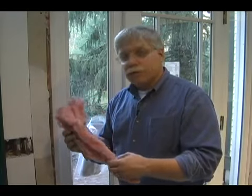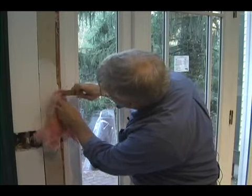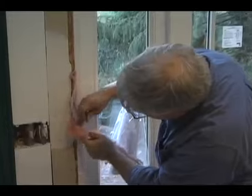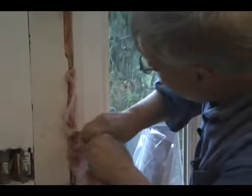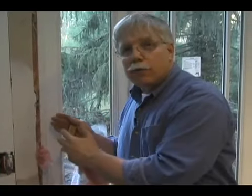I have to tell the truth — we finished putting the door in yesterday and it got a little late to finish the job. I went ahead and already insulated with pink fiberglass so that cold air wouldn't pour in through the night, but I want to show you how I did it, so I removed some right here. You take fiberglass insulation in narrow strips, and you rip off a piece that's a little bit longer than the gap that has to be filled. You want it to be kind of loose — you don't want to pack it in too tightly. I like to just use a wood shim or some small stick and start to stuff it in very easily. The key is not to push it in too tightly — you don't want to pack it in. Depending on how deep the door jamb is, you might have to put in two or three inches. I put about three inches of foam outside and we're going to have about two or three inches of fiberglass on the inside, and this door will be sealed nice and tight with minimal air infiltration.